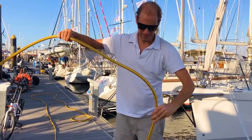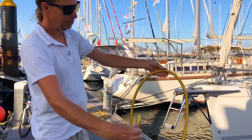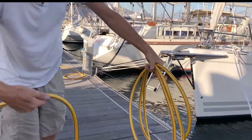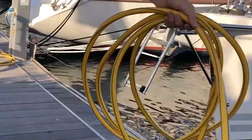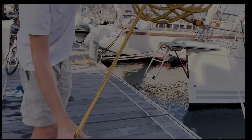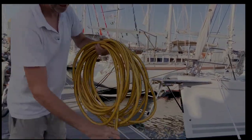The key to doing this successfully is to start with a hose that is not wound up, just very straight. You take the first loop in the normal order, and the next one you allow to go behind. It will look like it's not correct, but it is. Then the next one is in front, and the next one behind — alternating. You coil it without twisting it, and it's just as fast as coiling it the standard way.